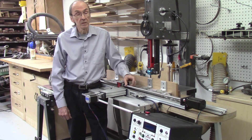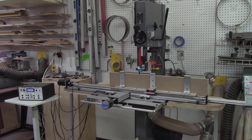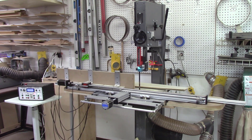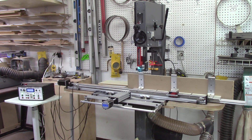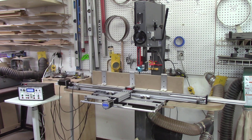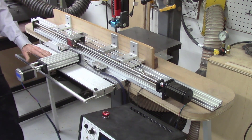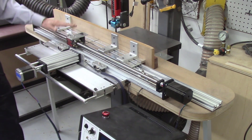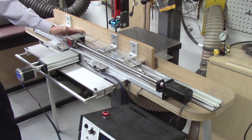I also cut a lot of segmented discs for projects I was working on. However, in doing the testing, several problems did arise. When we sliced longer and heavier boards, we started to see less accurate cuts. For example, when slicing a 40-inch long board, we saw an error of plus or minus 4 thousandths of an inch over the entire length. We attributed this error to the rigidity of the AccuSlide frame and the indexing of the boards using a single indexing system in the middle of the index table.